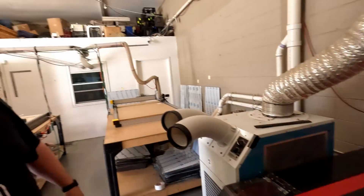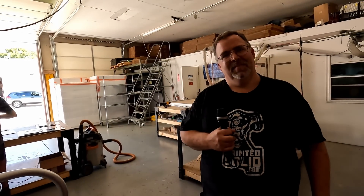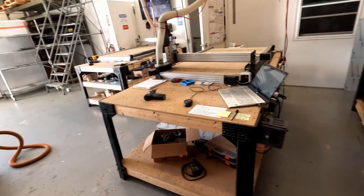Being close to one of the country's larger acrylic recyclers, all acrylic scraps and remnants are 100% recycled back into new acrylic, keeping a low footprint. ACM unfortunately can't be recycled as a composite material, so they maximize usage and minimize waste by using a panel cutter to plan cuts precisely, reusing cutouts for other parts, and even lining the undersides of tables with scrap ACM.